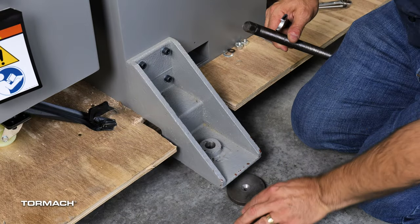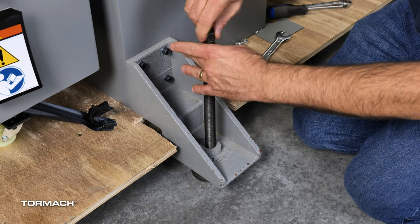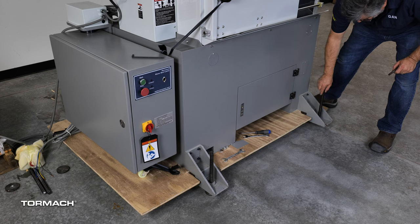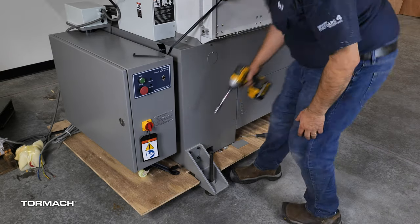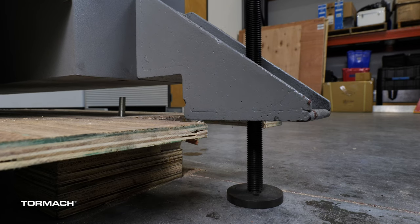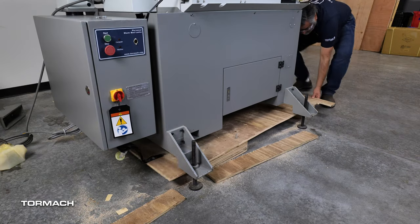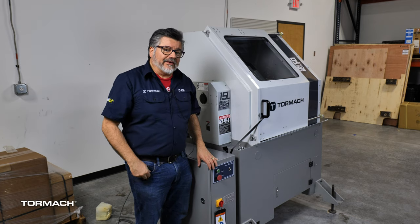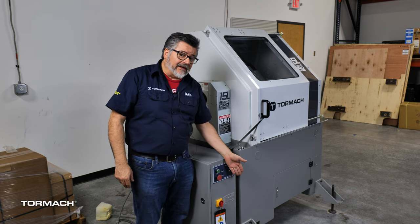Slide a lifting pad underneath each of the four installed lifting feet. Thread each M20 threaded rod through each lifting foot and into its lifting pad. To raise the lathe with a threaded rod, a socket wrench will work but an impact wrench is better. Gradually adjust each lifting foot to raise the lathe evenly until the lathe is clear of the floor. Cut off any remaining section of the pallet floor, then slide the pallet from underneath the lathe and discard. Since this video demonstrates turret installation inside the enclosure, keep the lifting feet on until we get to that point.